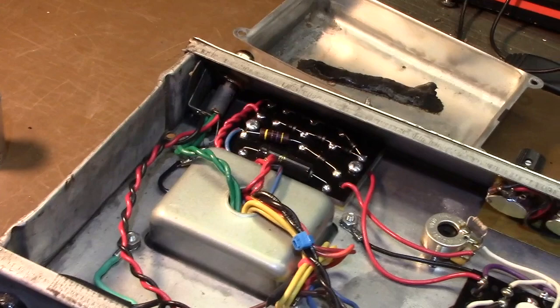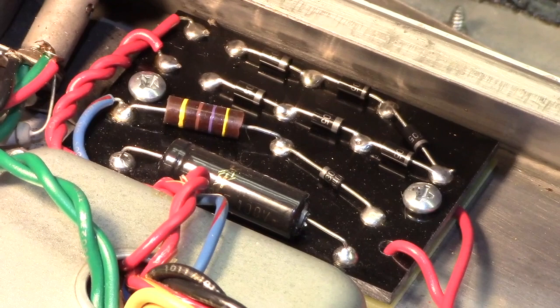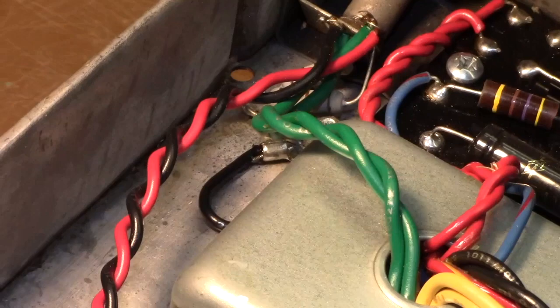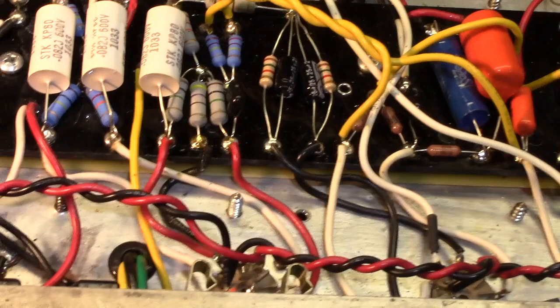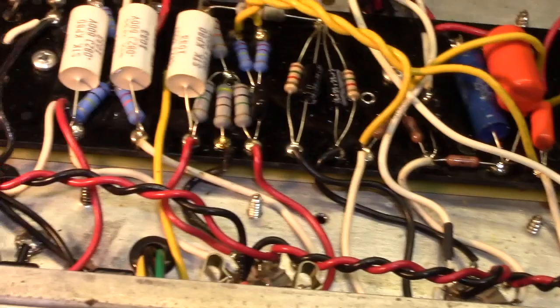Down there is your rectifier and bias board. You can get some light on it — with your six rectifier diodes at the top, and then the bias supply components at the bottom. The usual stuff I like to use. And underside of the power transformer, there is your pilot light turret — or bayonet as they call it. We'll flip this thing around to the other side so you can see the tube sockets a little better. This is all pretty standard stuff for the way I do things. I do filaments a little differently now — I use a finer wire and do a lot more twists. But that's what I was doing at the time, and it still works, so I left it alone when I redid it the last time.